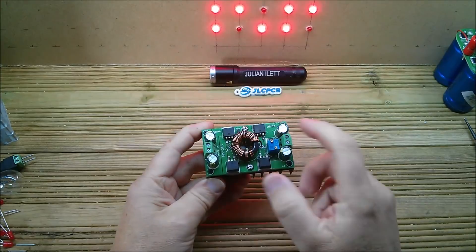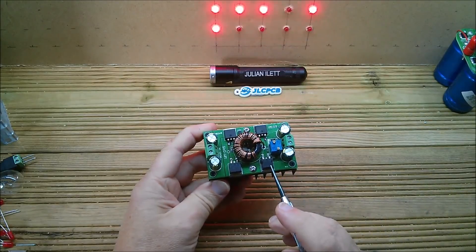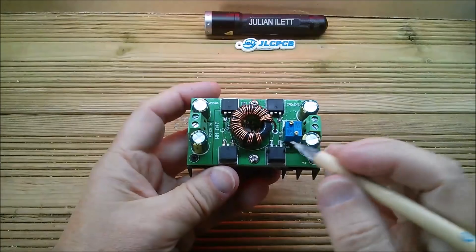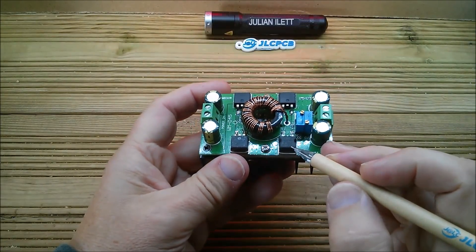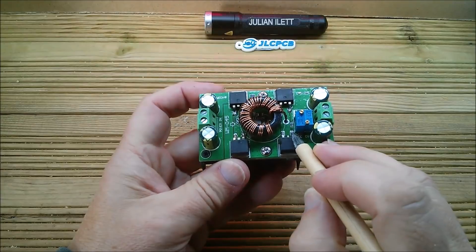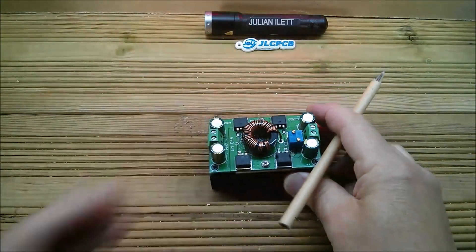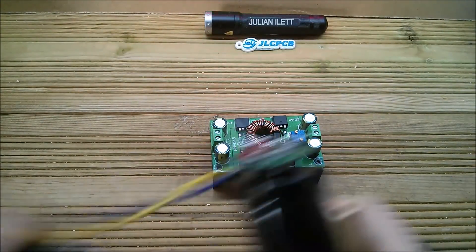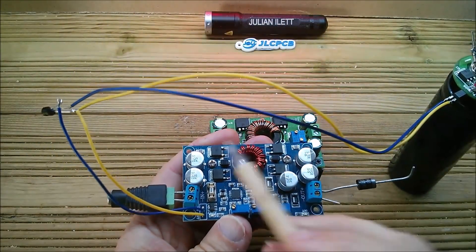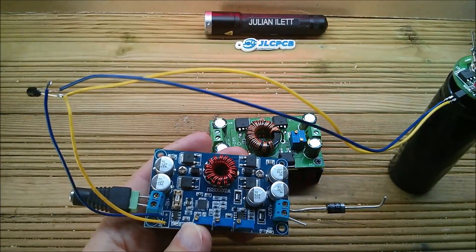It has what looks like four MOSFETs, but they're not — because you can see this one looks slightly different, it's got these two cut-in sides. This is a diode, it's a dual diode; both legs here are actually connected together. So it's a three-MOSFET buck-boost converter. I thought when I bought it, it was going to be a bit like the LTC3780, that chip with four MOSFETs surrounding an inductor, and they've done a similar layout to make it look like that.